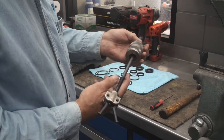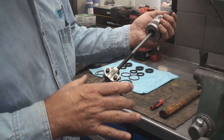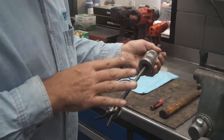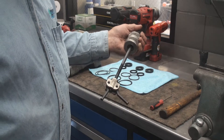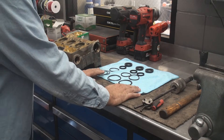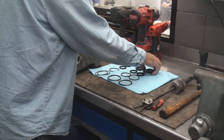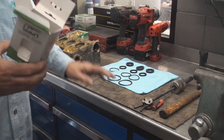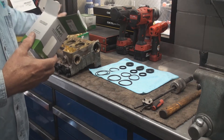This slide hammer is unique because as you turn it this way, they expand out. If you don't have a slide hammer and you're in an emergency, you can hook it with something and tap it — you can improvise. But before I start, I always lay out all my parts. I open the kit, dump it out, and lay out two packing, two packing, two packing, and then the parts — because if they short you one part and you're in the middle of a job, you're in trouble.